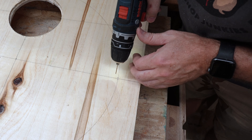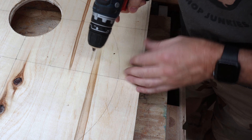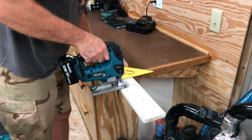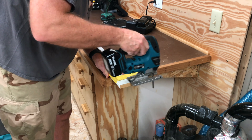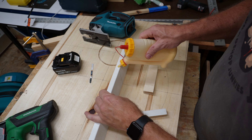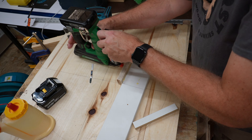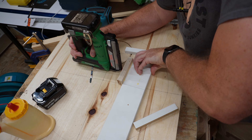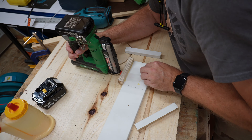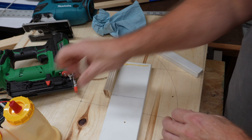I was going to show you more of this drilling process, but that was boring — get it? Boring. This is a very simple jig for cutting perfect circles with a jigsaw. I'm starting out with a board that is about 18 inches long and 4 inches wide, and I'm attaching to one end some scrap pieces. The size of these isn't that important — just make sure that they're straight and square. I made the two side pieces the length of the jigsaw base.